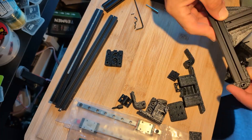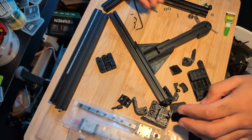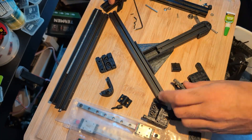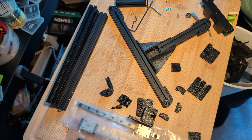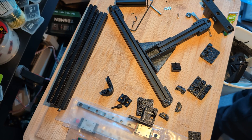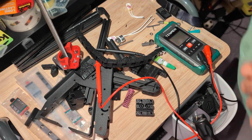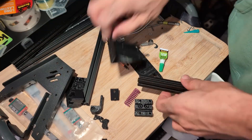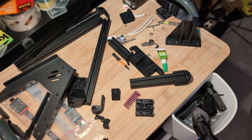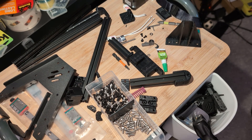The Tri-Zero, on the other hand, is a three-point tilting bed. You can get three points to define a plane, and then the bed can be trammed automatically instead of me having to manually tram the bed as best possible. This means I don't have to mess with any springs or tiny screws. There's no paper test that I need to run — it will just work.